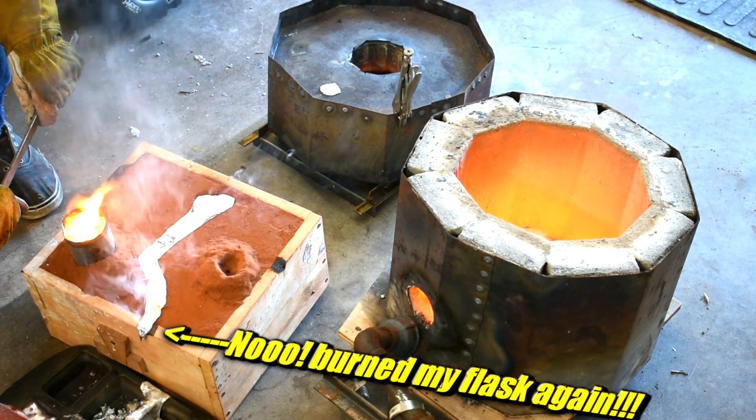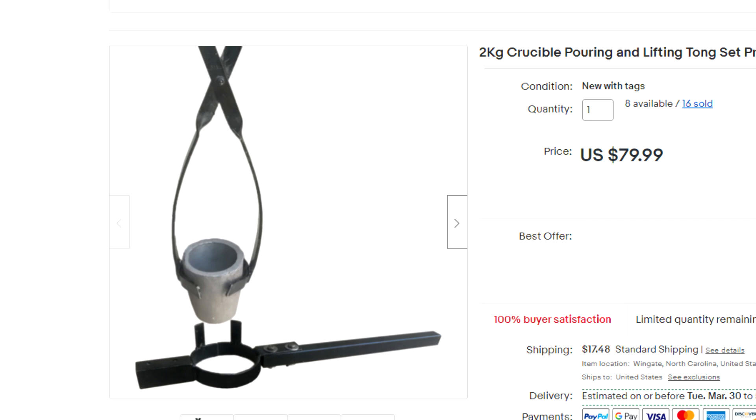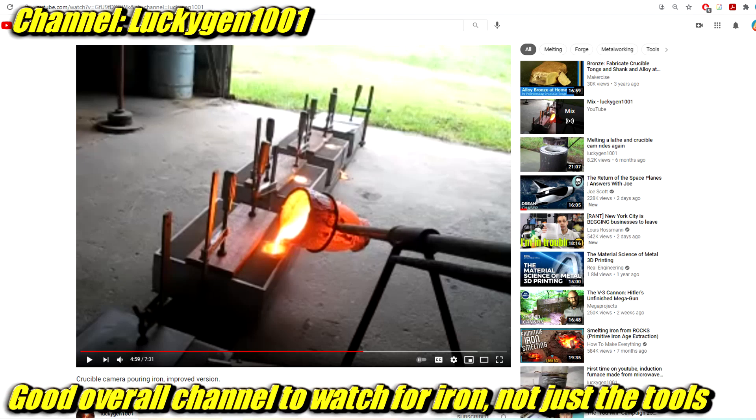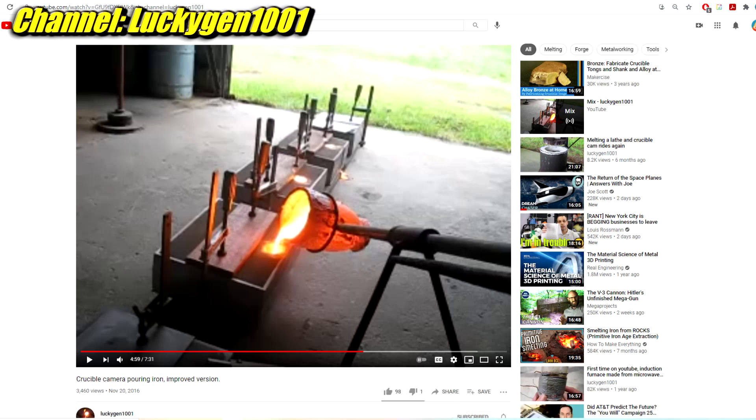So I think what I'm looking at is a design involving jaws like the lifter. The shank has a couple of cool variations though — if you're lifting a lot of weight, there are shanks with length sticking out both sides so two people can do it. Or if you look at the YouTube channel luckygen1001, he does a lot of iron. Iron's really heavy and he pours a lot of it, so he actually has a shank on a wheeled tripod so one guy can just wheel the thing over — he's not holding it up, just maneuvering this wheeled device. The lever coming off the end holds the crucible closer to the wheels, the fulcrum point, than what he's holding, so he's got a lot of extra leverage. It's a really smart idea.